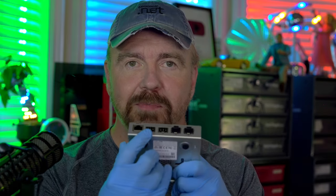Last time around I showed you the SFP Plus port, which is completely different from the RJ45 ports we're all used to. There are four SFP Plus ports on this MikroTik switch, for example. I also introduced the notion of a transceiver that allows you to plug in various cable types into the same SFP Plus port, including Cat6A twisted pair.